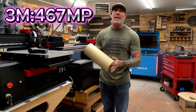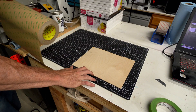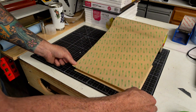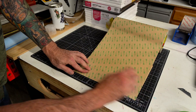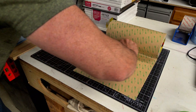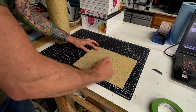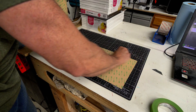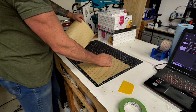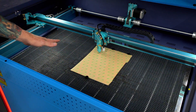There are a variety of ways to create a stacked or layered sign, but for today's project we're gonna be using some 3M double-sided tape — model 467MP. This is a very, very thin double-sided tape. We're using another scrap piece of three-millimeter Baltic birch. I'll position the tape, keep a little slack in it, start at one edge and slowly work to the backside, trying to eliminate any air bubbles. Use a squeegee or roller for good adhesion, then flip it over because this needs to be double-sided.